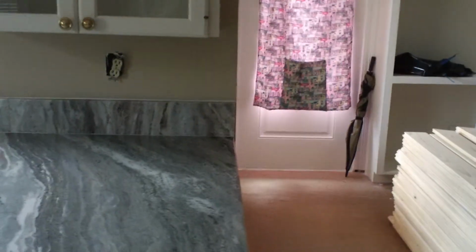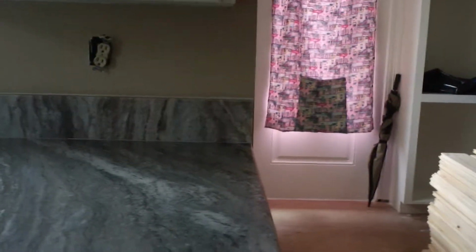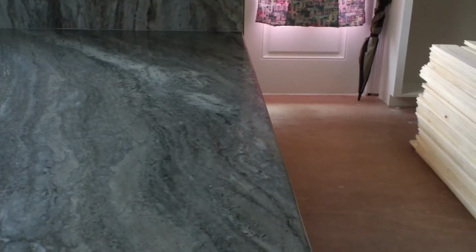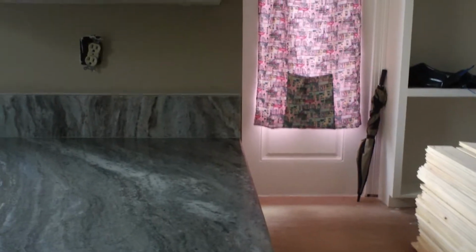This is pretty wonky right here. And then this is where you start with another one of his lines with the overage that needs to be cut. There's another line right here where this needs to be cut, and then this needs to be cut as well, but the problem is you have a sheetrock wall over there, and I don't want them cutting into my sheetrock, because obviously that's going to be a mess. It overhangs about 1 inch more on that side than it does on this side. And we're not talking about a huge run. I mean, this is 7 foot.